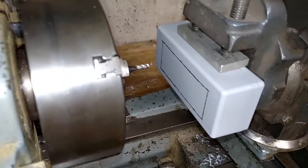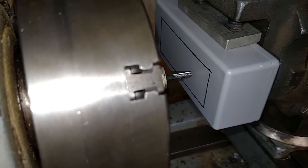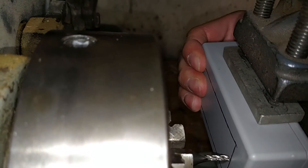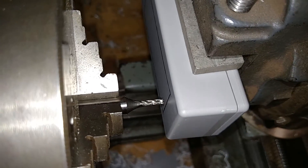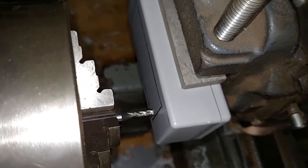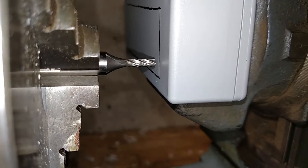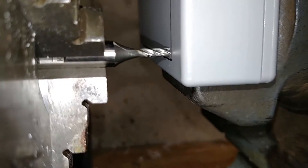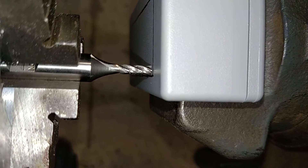It gets the job done. We're going to come up real close and then move this over so we're starting at a nice point. We're going to try to line up our line — get right on the corner. We're going to be right on the line because I can always file it. It's easier to take away material than to add it back.